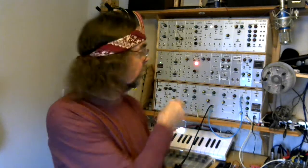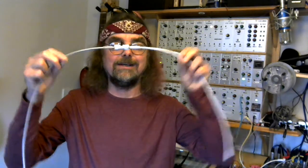I decided to do this because I salvaged some tiny little potentiometers and thought I could use one to build one of these Patch Pal things. With a DIY system like my Project 12, it's all analog and there isn't a consistent voltage running through it — you have quite a wide range of voltages. Sometimes the voltage coming out of one module that you want to feed into another can be a little bit hot, so the best way to cool it down is to attenuate it.